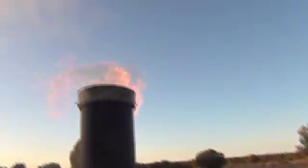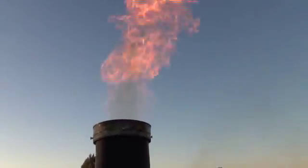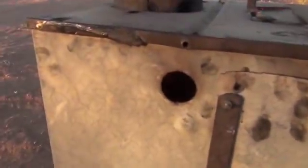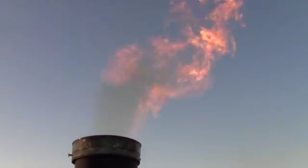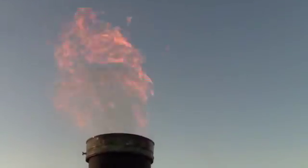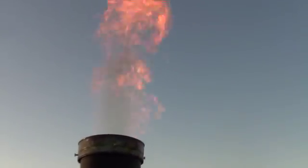So there's the door shut down. Now if you notice out of the top, it looks like we've got a propane or a natural gas burner going here. We've got both a heavy syngas fire going on inside the stove and also a four-foot flame coming out of the top of our chimney pipe. The only reason that's being affected right now is because of the wind. But obviously there's a large amount of syngas production here — that's why I realized I could still run a generator off this wood stove even while it was heating my house. This is a huge flame raging out of there once you shut the door down. So I've got to figure out another burn box above this wood stove to help disperse this heat into the house. That is definitely not what you want to be wasting.